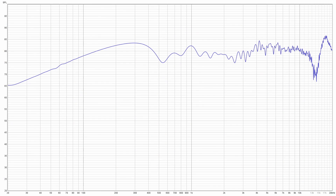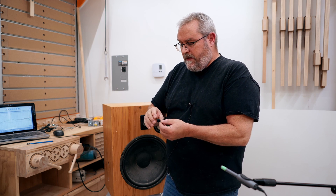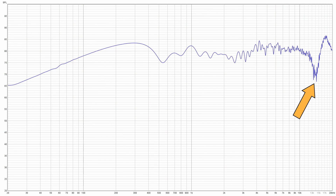That made more of a difference than I thought it would. I've got a hole now at 14k — that's probably deeper than the one I had at 3k when the tweeter was reversed. It was this little piece of plastic right over the cone that made all the difference. You can see that it dips down at around 14k and then springs back up after that, peaking up actually quite a bit higher. This did a lot of correction. So I'm thinking the same thing could work with my horn if I experiment with the shape.